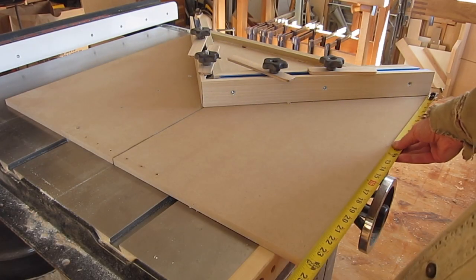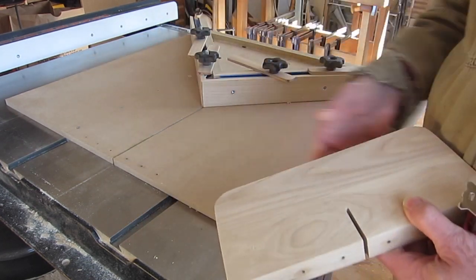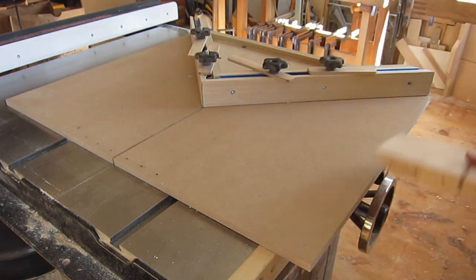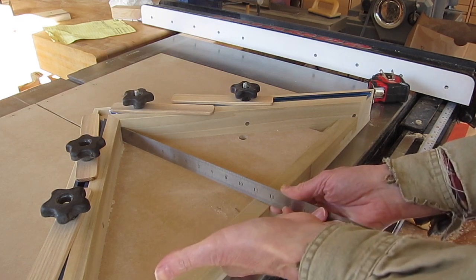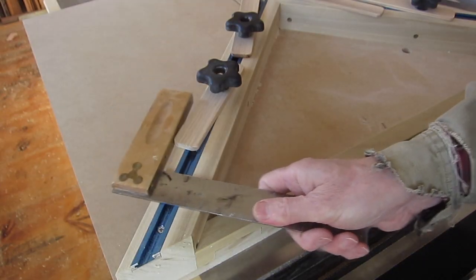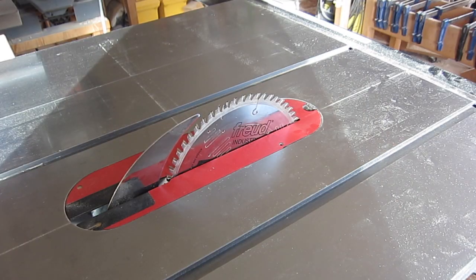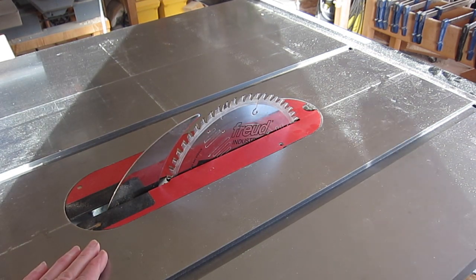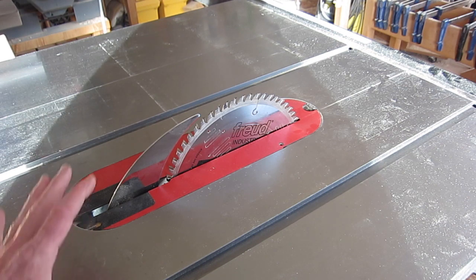Dimensions: 30 inches wide, 24 inches deep. If it was deeper then the back fence could be further out and I wouldn't have to remove it when cutting wider pieces, although I've been using it without the back fence and it hasn't really been an issue. The tip of the MDF triangle is 12 inches from the back, and from that all the other dimensions fall into place — the length of the side pieces ends up being 21 inches. The fences I made two inches thick and two and a quarter inches high, and the base is one-half inch thick MDF. It's a good idea to calibrate your saw so that the blade is parallel to the slot before you make the sled. I'll provide a link below on how to check whether the blade is parallel to the slot, and if it's not, you'll have to consult your owner's manual because the adjustment is different on every saw.